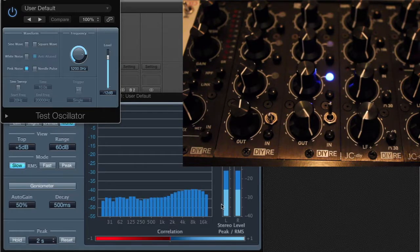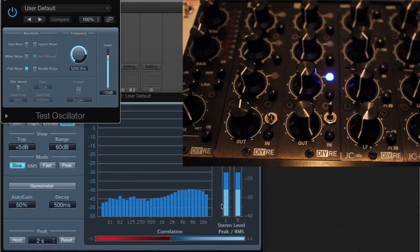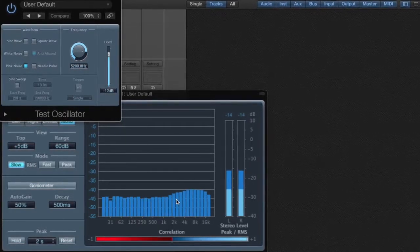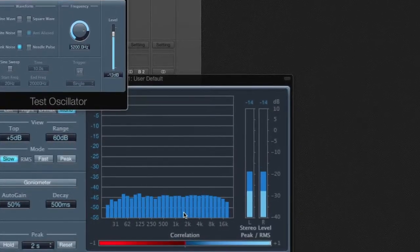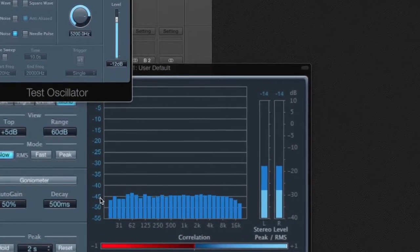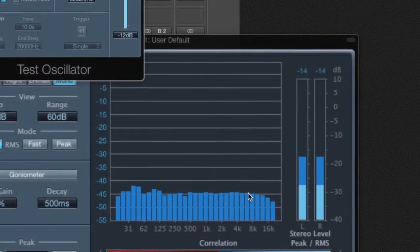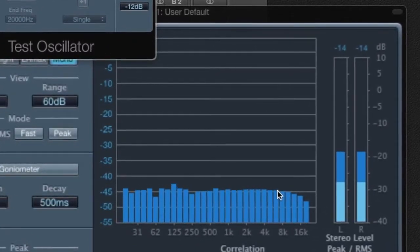And clearly we're getting a good amount of boost at that high end of the frequency spectrum from roughly around, reaches down a little bit lower than 4K, and from the markings here we're getting roughly about 45 to 40, so roughly a 5 decibel boost in that upper range, which is exactly what it's supposed to be. So awesome. And that's how you can tap an internal switch on a color module to be able to have access to that function while in operation.